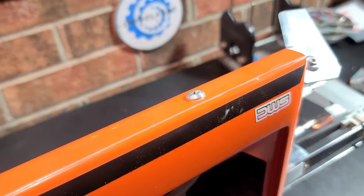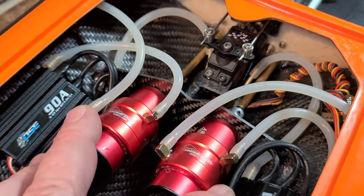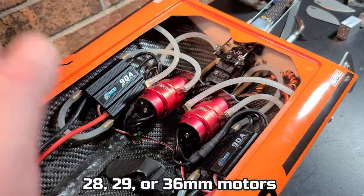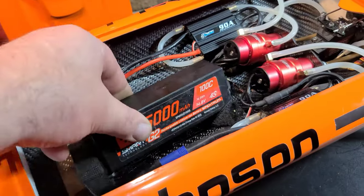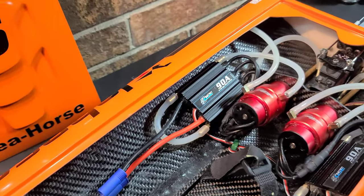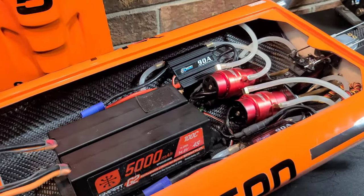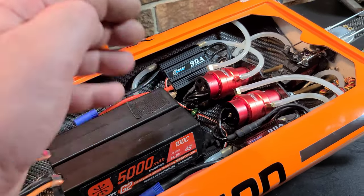I have exits on each side, identical. I made the motor mount big enough to house 2968 or 36mm motors later if I want to upgrade. The boat is pretty light. For batteries, running a single battery for both ESCs in parallel worked well in my drag boat. You can also run dual batteries, but two 4S packs is essentially 8S — that's heavy.